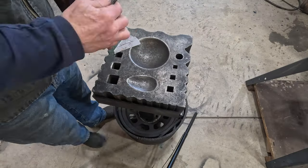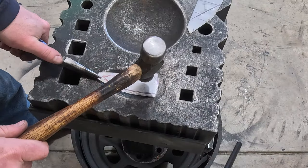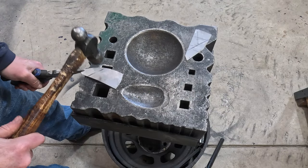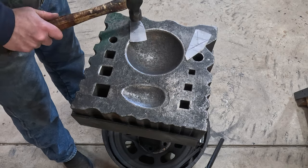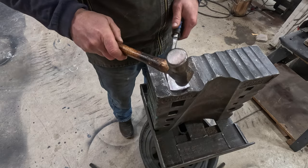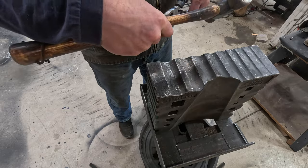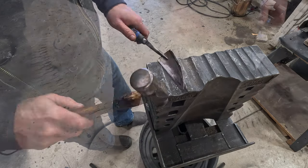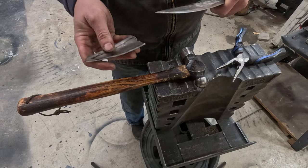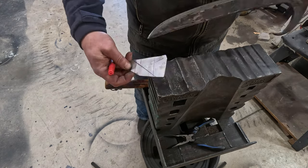So I set about making three separate pieces — two of them being almost ringlets, and then a last piece to capture the tip of the blade. I'm often fascinated by how much mental power it takes to come up with these concepts. Essentially it's just a pipe, but I had a really difficult time finding a pipe with the right thickness to hammer out these sections into elongated ovals. For the tip section, I just needed to make that straight out of 14-gauge steel.